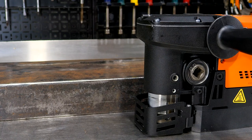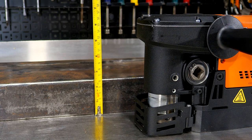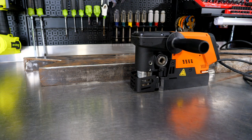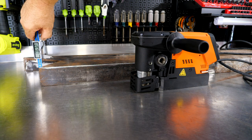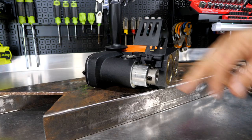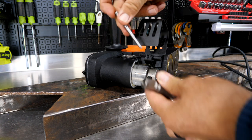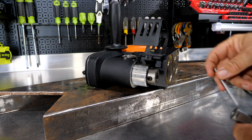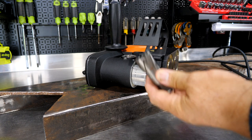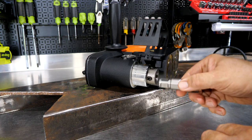What we have here is a piece of channel — an eight-inch piece of channel. It looks like it's got skirts of right at two and a half inches, two and three-eighths of an inch, and three-eighths inch thick. Now, if we had a hole marked with a center punch, then we would probably want to run a center pin in there, which you could easily do. We don't need that — we're just going to be cutting a hole. We'll use the annular bit as it is without the center pin. So based on what you're doing, you may want to put that pin in.